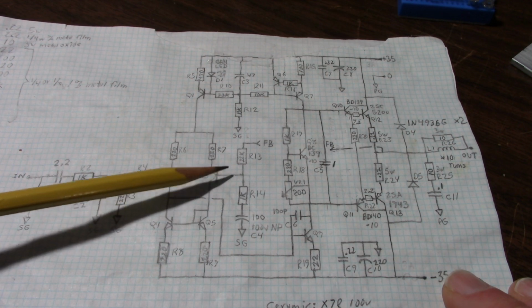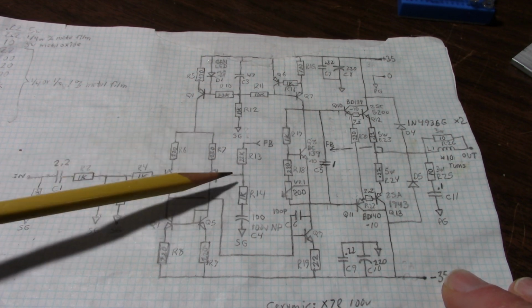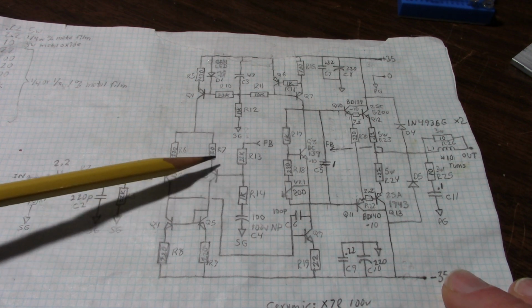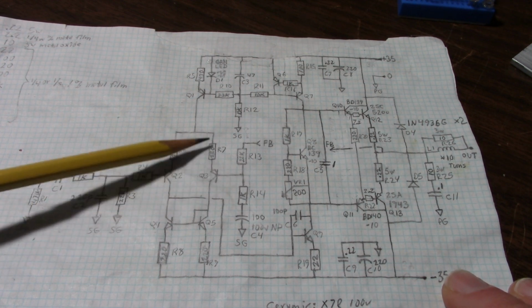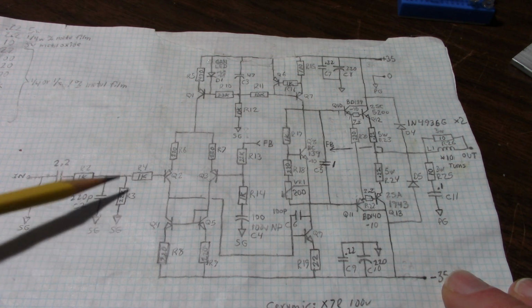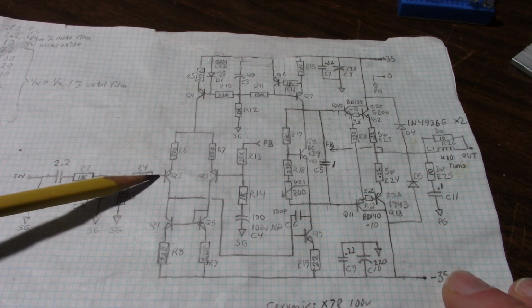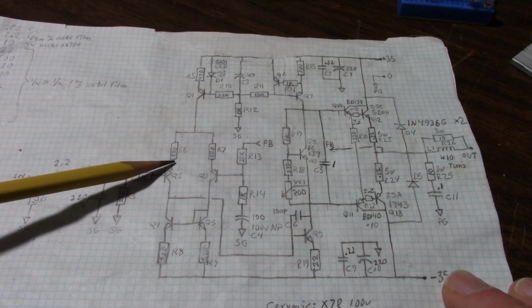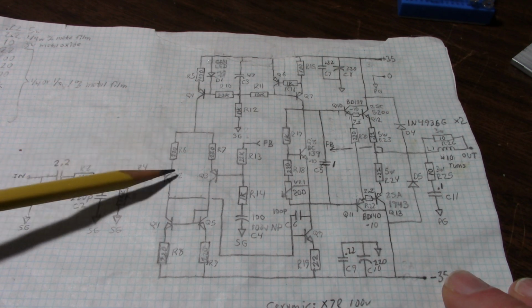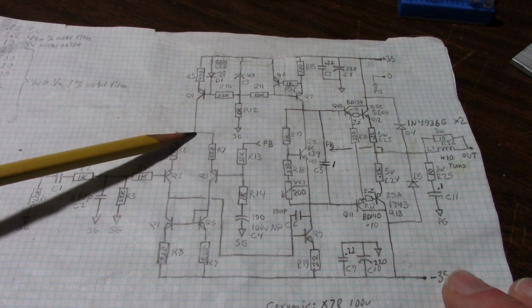With a high voltage here, you end up with the output voltage here of 30, 35 volts, whatever it was. And the emitter is close to ground. If you remember, this resistor here is what sets the ground reference point. So this is close to zero. This would be a base emitter junction drop, a small drop across this resistor here. So this is about 0.7 volts above ground.